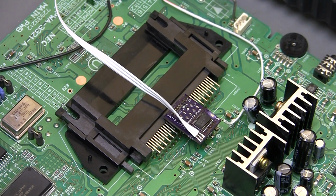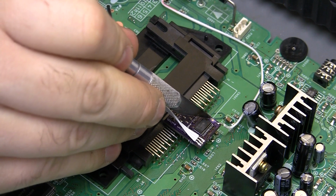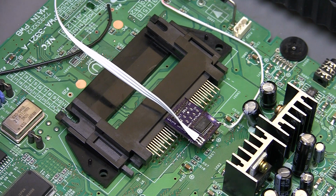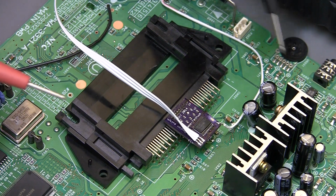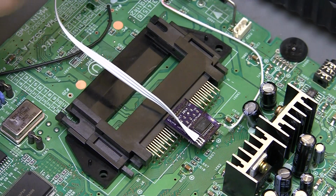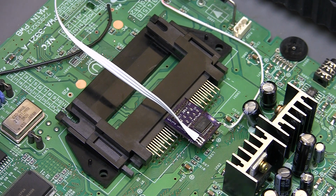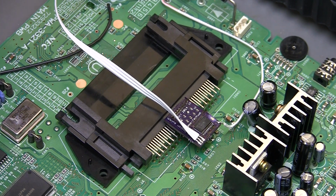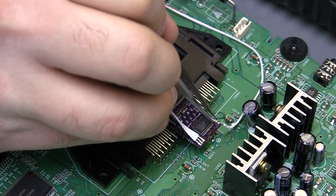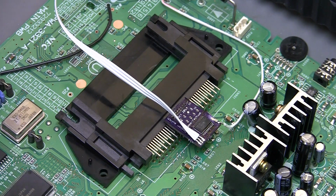Well, I had the bright idea to get this power bypass cap on here is to scrape away some of the solder mask right here next to the VCC pin, and I can check for ground, and it's ground, which I knew it was. Just want to be extra sure, and that way I can throw on a little surface mount cap like so. That'll be between VCC and ground. So I'll get that done and then we can button it back up.